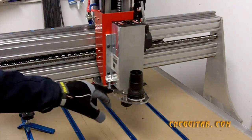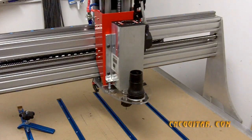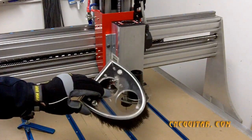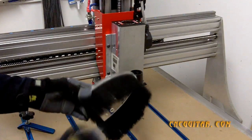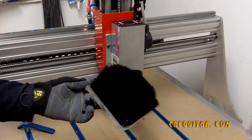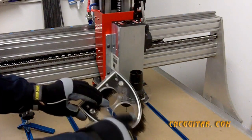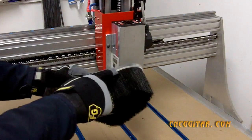There are some rare earth magnets that allow me to change dust skirts. Out of the same material, I create a dust skirt. This one has plastic bristles, and they come in all different lengths and materials — this is plastic, you can also get them in horse hair. In SolidWorks I designed the model, created a groove, and put those bristles in there, as you can see.